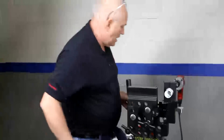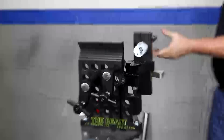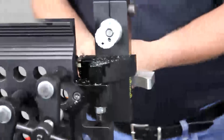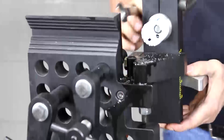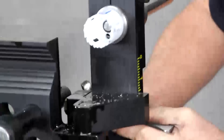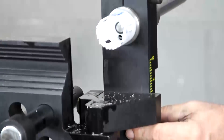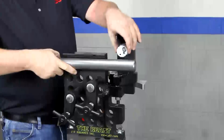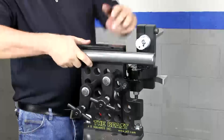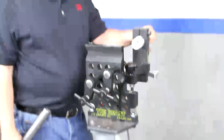Offset notching — I'm not going to actually cut it for you since you've already seen two notches, but let me show you how it would be adjusted. You have a little bolt over here — break the bolt loose. Your scale on the side will tell you how high you are. Let's say we're notching three-inch tubing and want a 50% offset — we'd move up to the inch and a half mark and relock it. You can see we're considerably above the center line of the tubing. If we moved it down to the three-quarter inch mark, we'd be dead in the middle. Make the notch and away you go. That's pretty much the Beast right there.